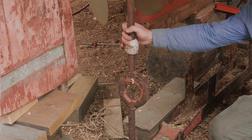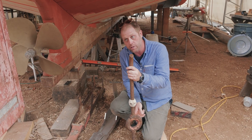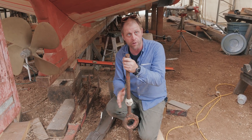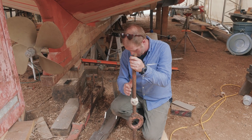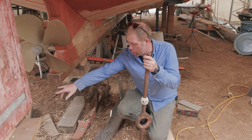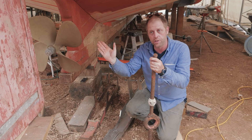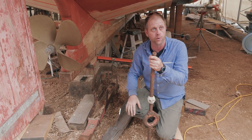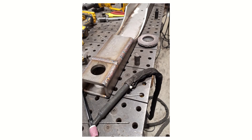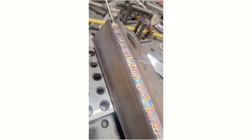We've been working with the team here to figure out a method to accommodate a similar structure. This one here you can see had a hole cut through the center of it, which would allow the prop shaft to be pulled off the back of the boat without removing the shoe and post. We're going to make a removable compression post for it — that was the other thing we're here figuring out — what spacing is needed from the forward edge of this rudder so that the post can be installed and removed without taking other components off the boat. We think it's a pretty good design, so now it'll go back to the shop, get hard welded out, and we'll bring it back and put it on.